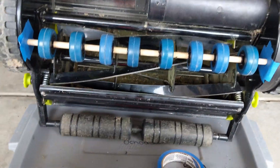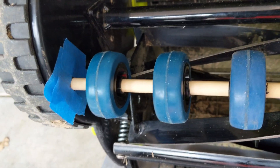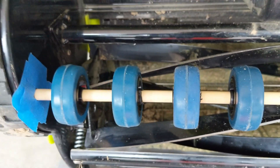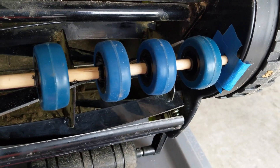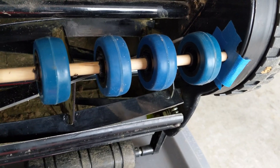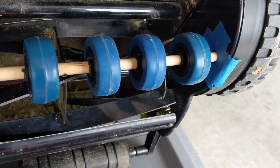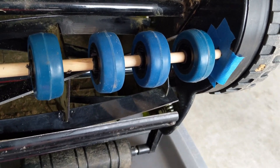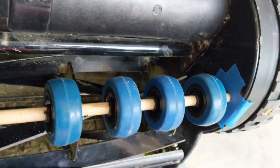I've got it up on a makeshift workbench. You can see the holes are marked with tape. The dowel is flexible enough that I can pull it out without moving the center hole. Then I'll use a small pilot drill bit first — drill the pilot through this side — and then drill the main hole.